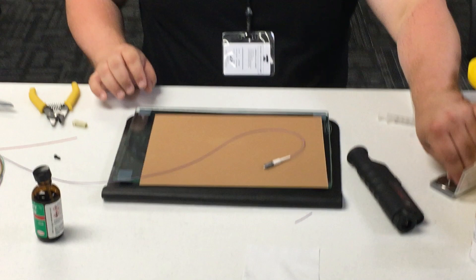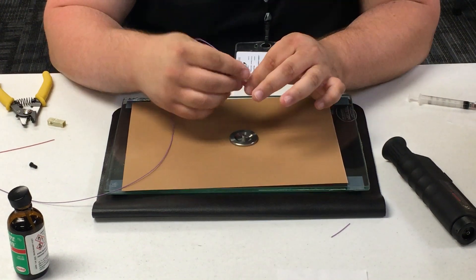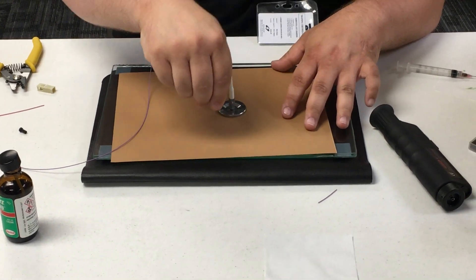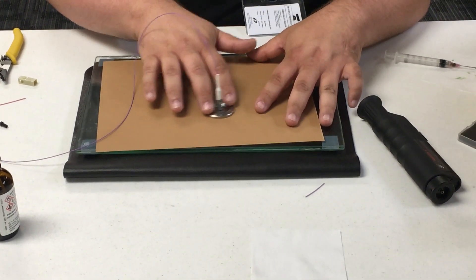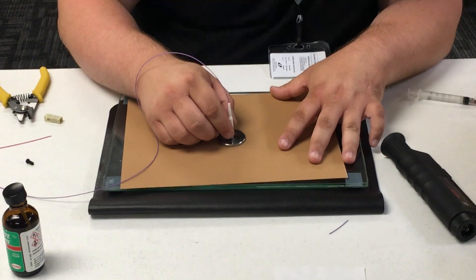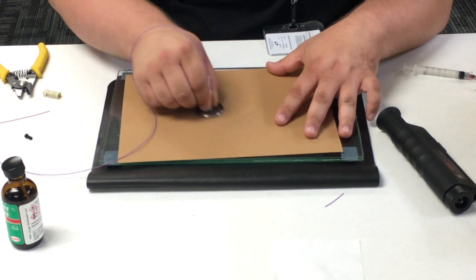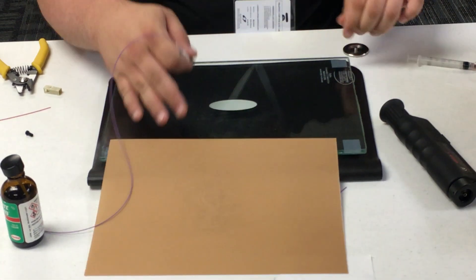So now that that's done, I do not air polish — I'm just very careful with this first step. I'll get the connector into the puck and almost just let it fall in. I'm not putting any pressure down on that connector just yet, because this essentially is the air polishing part for me. Then I grab the puck and slowly do my figure eights. Once it's smooth, I grab the connector, very slowly do my figure eights. Once I feel that it's smooth, I just increase pressure a little bit. And then once I get those eraser marks on there, I'm done with this sheet of paper.